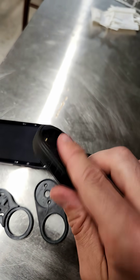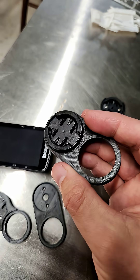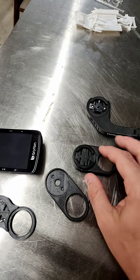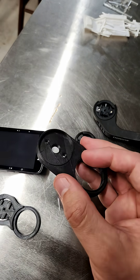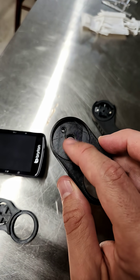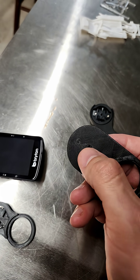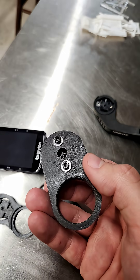You can just unbolt them here, and then you can just bolt it right into your simple 3D printed mount, which actually looks about like this. This is an earlier version of mine. It's not 100% infilled, whereas the final one is 100% infilled, so this is just solid PLA plastic, whereas this one's like 10%. But this was a prototype. I just wanted to show you where that mount goes in — it goes in right at that piece there, and two bolts go through. This hole in the middle is really just so you can push out the mount if you need to.